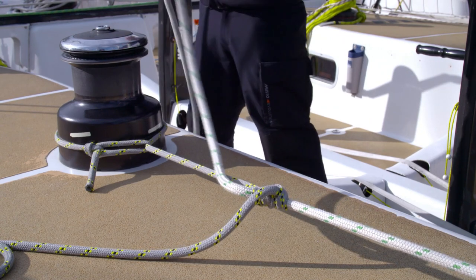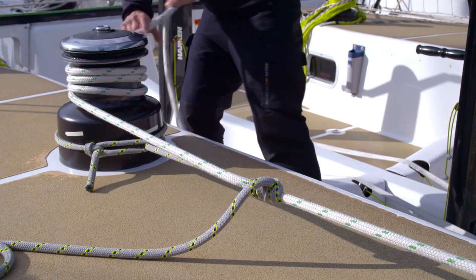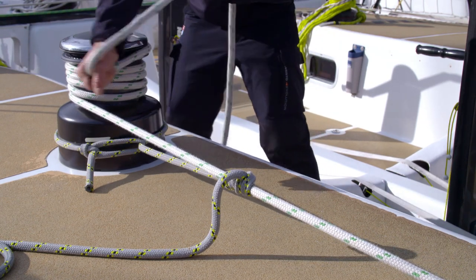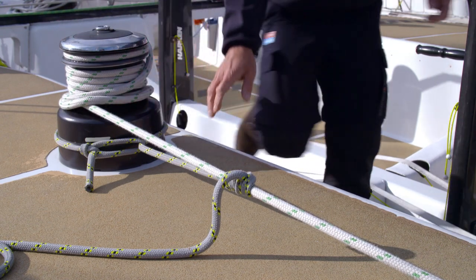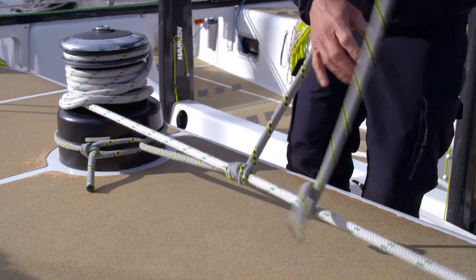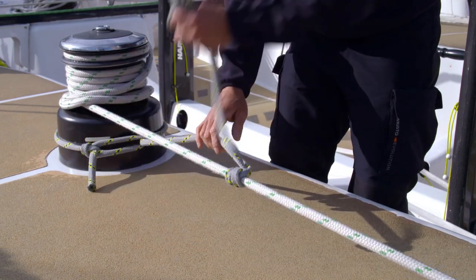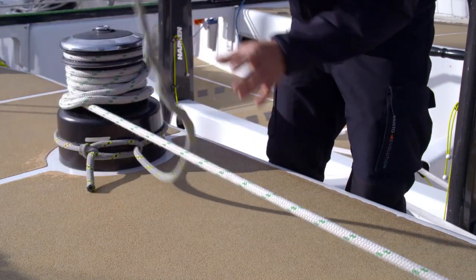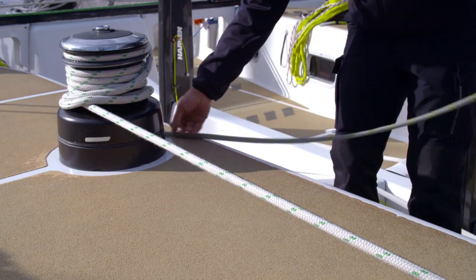To get this off, all you're going to have to do is fully dress the winch again, load it up as best you can, make sure it's locked with a couple of safety turns on — and that has unloaded this part of the rolling hitch and we just reverse the knot. Once that's free, take the loop from your anchor point and you're good to go.